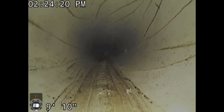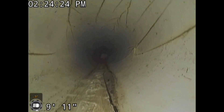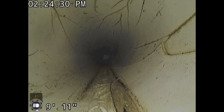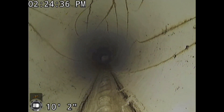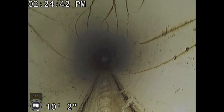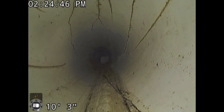It's amazing that they're able to still use this pipe. You can see cracks on the sides, on the top, even on the bottom — some really big cracks. Catastrophic failure. You're starting to see separation. This is causing the sinkholes in this yard. Anytime you have settling of the ground, shifting of the ground, PVC pipe is going to crack like this.